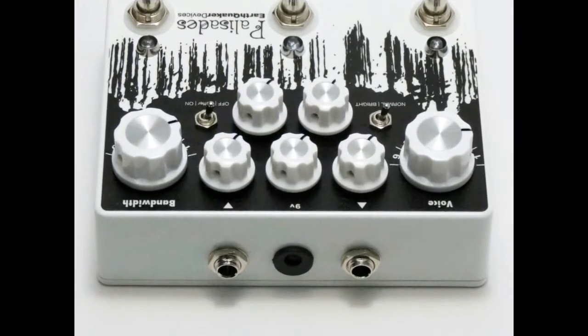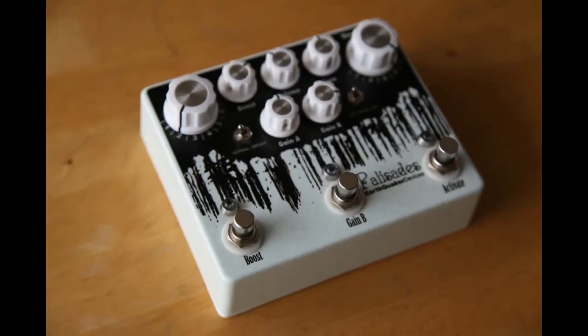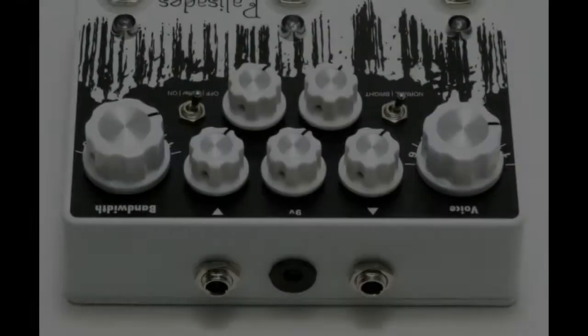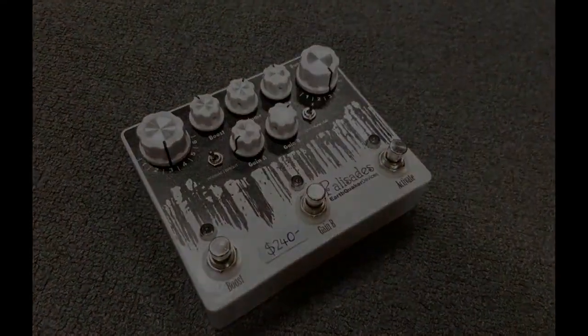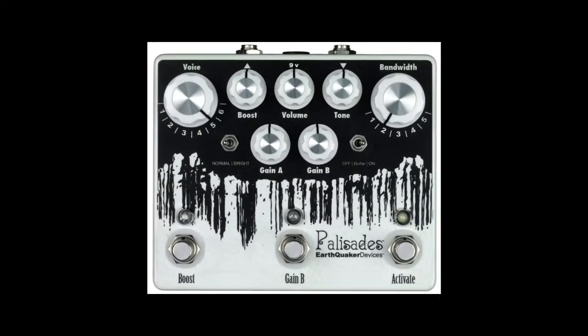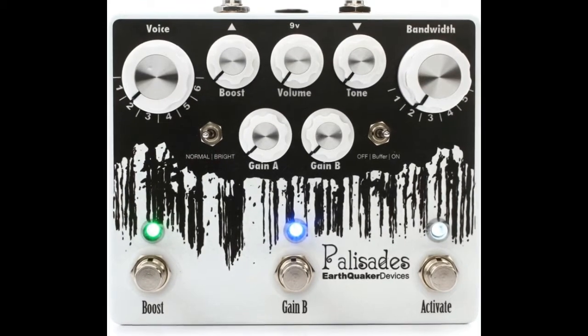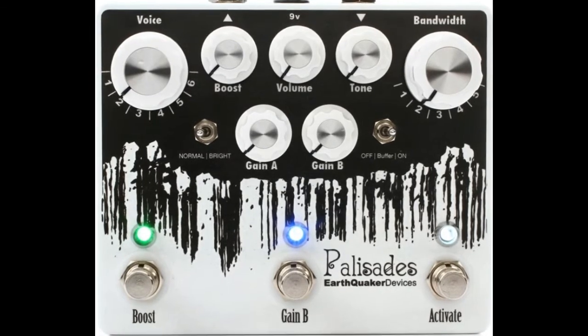In use. Hang on. The TS clips symmetrically, right? Well, the Palisades' 6 voices are listed as no diodes, LED, MOSFET, asymmetrical silicon and Schottky diode, and voice 4, asymmetrical, is built as the closest to the classic TS-808. Does it sound like it? Well, actually not.